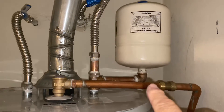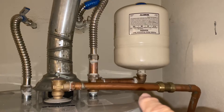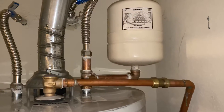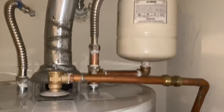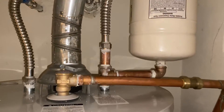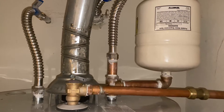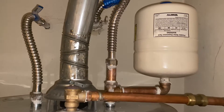It's a lot more expensive. So you just spend about 70-80 bucks on the tank and the fittings. Here's the expansion tank — you basically just go to that nipple coming out of the water heater, put a T there, go over with a brass fitting, a brass 90, and screw that water tank in there.